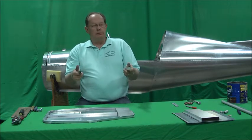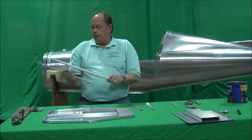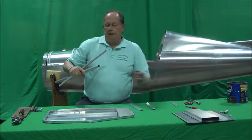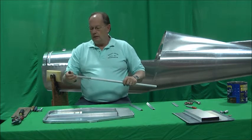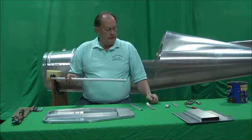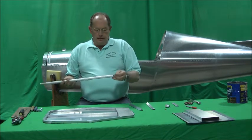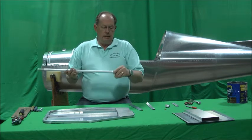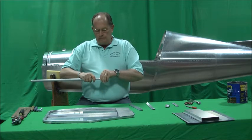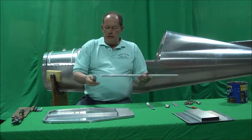These angles get flush-riveted under the side rails, so you've got the holes in the center here. It's basically made from two pieces of tubing, three-quarter and five-eighths, that size-wise slide together real easily. There's a five-eighths die spring that goes in to allow the compression. I've already riveted the rod end bushings - in this case they're just bushings that we put in the ends. Then the plans will tell you to take two AN7 bolts, cut them off and grind a bullet shape on the tip. You can loctite these in; it's probably a good idea on each end to bottom the threads all the way out. That makes it adjustable by squeezing it - it compresses and snaps into the holes on each side of the side rail.